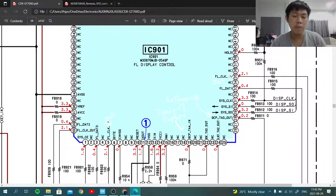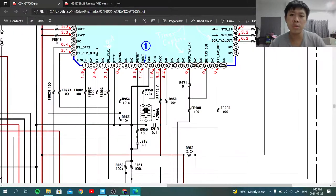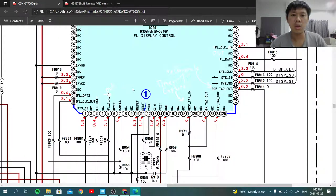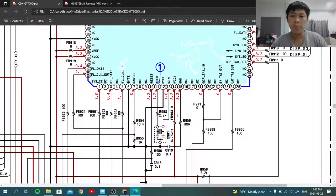But like, if I want to have at least 3 serial outputs, I need to use a quad SPI, which is none of my hardware available. My STM32, this one is the top line, the only one that I have. This is probably the most powerful microcontroller that I can use right now on my hand. And it's only capable of a single wire SPI, I mean a single master out, a single data line, not like this 3 data out line. So either bit banging or this method that I'm talking about will be the way to control the display.